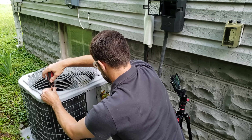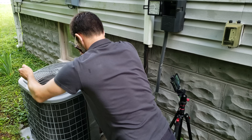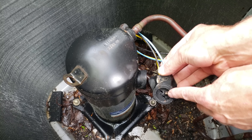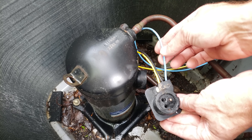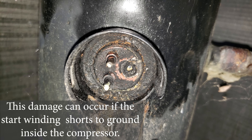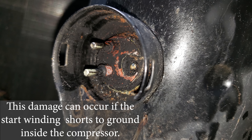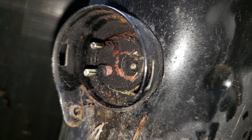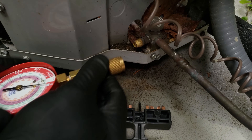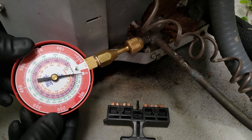We disconnect the top shroud to get to the compressor plug and wires. We find burn-off terminals on the blue wire leading to the start winding on the compressor — that's not good. Looking at the side of the compressor, we see a missing terminal. Now we're wondering whether all the refrigerant has leaked out where that burned-off terminal is, so we check for refrigerant pressure at the liquid line service valve using a quick-connect test gauge.